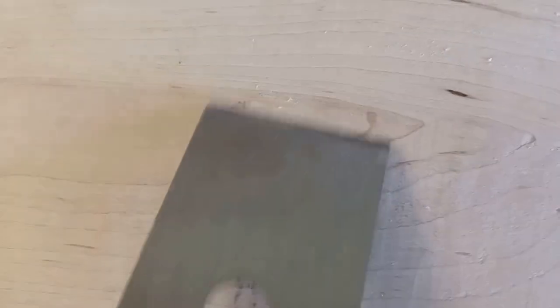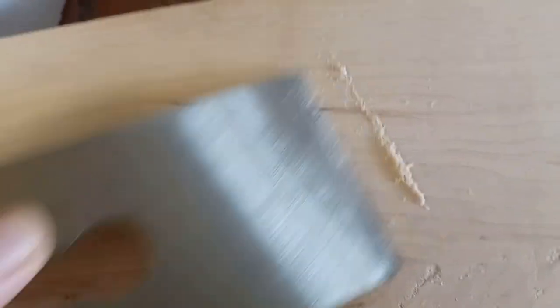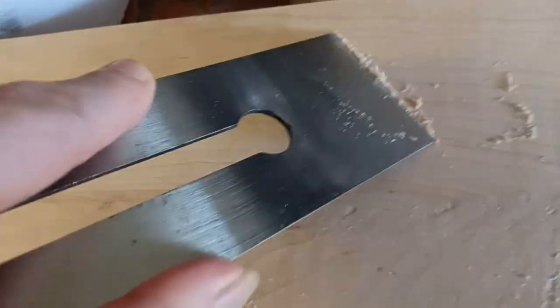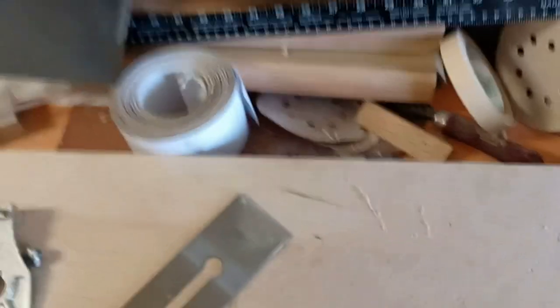The next segment of the video is going to show you why. The blade is fine, the blade is super sharp — I can take this right now, and that's just light pressure by hand, not even at the right angle. It's plenty sharp for planing, but the sole of the plane is so far out of whack it's not even funny.